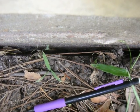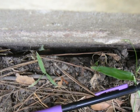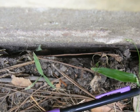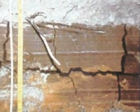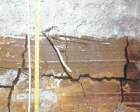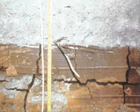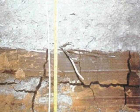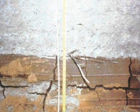Here you see where the soil next to the foundation has pulled away from the edge of the slab. If the soil stays dry long enough, the soil will fracture and pull away from the foundation underneath the slab. This photograph was made after a saw was used to cut through a slab to expose both the slab and the soil underneath. As you can see, the soil is extremely fractured — it's crumbling, literally falling apart. In this kind of condition, it can no longer provide proper support for the foundation. This is what we want to use a watering system to avoid.